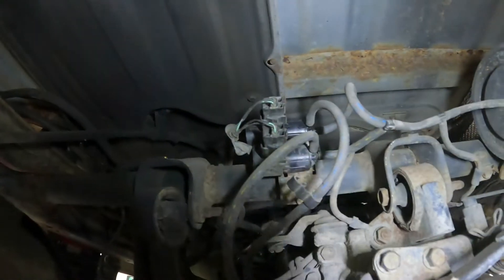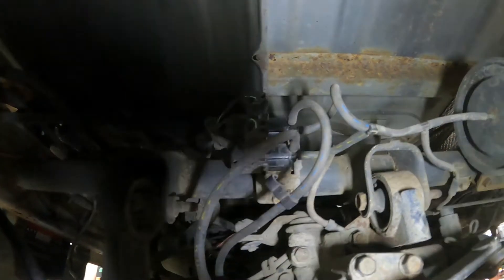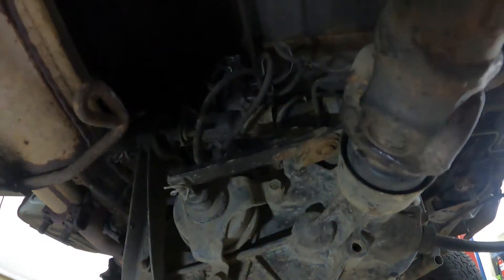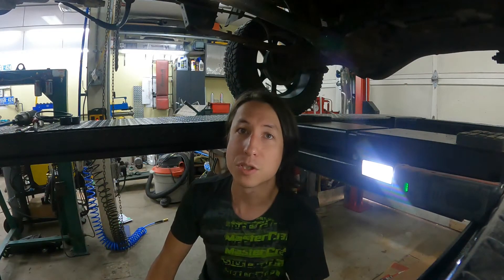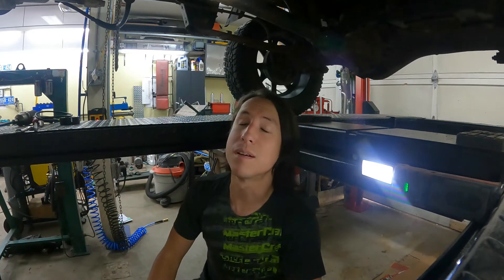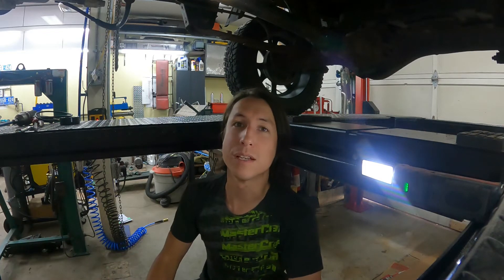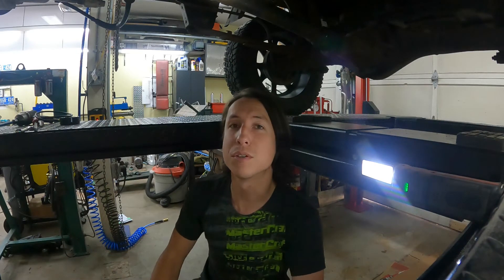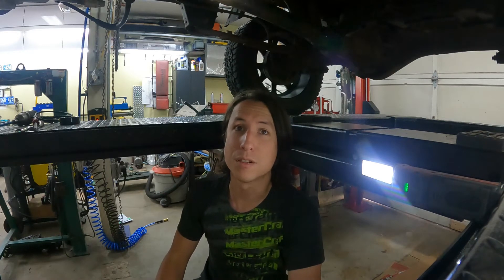I did a little bit of work on the solenoids up here — the top one wasn't functioning at all. I tried the sonic cleaner and oddly enough it worked, so that solenoid is functioning now. But I'm getting power to both solenoids at the same time when I push the switch. I think I likely have an electrical problem because the front solenoids are getting no power at all. I don't have a wiring diagram, so I'm going to ring out all the wires with the ohmmeter and hopefully come up with a rudimentary wiring diagram to diagnose what's going on.